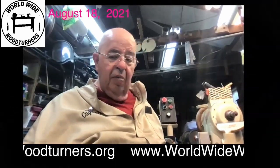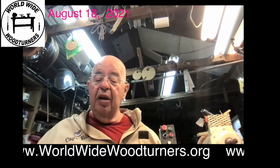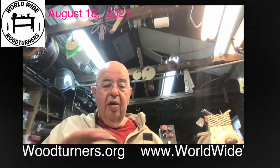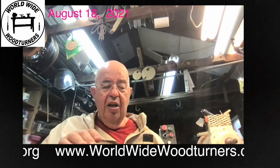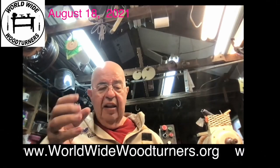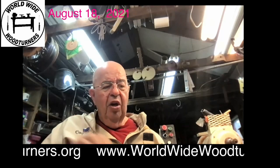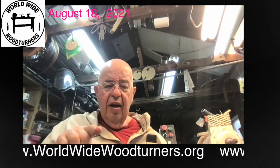Well, my best friend out here today, and I look and see where I moved it to, is that bottle of super glue. Because on a black palm and even on a spectra ply, I will drizzle it with the super glue before I get to the final sanding and finishing, because number one, it tightens it up. And once you put the first coat on, and I'm talking regular CA folks, you will see what your finish will look like. It's not a finish, but it'll let you know what your finish will look like.